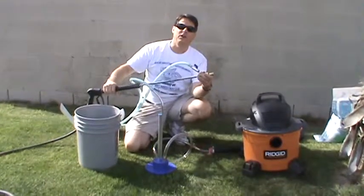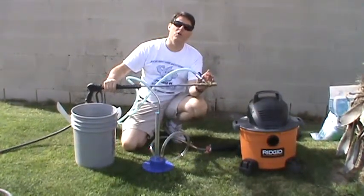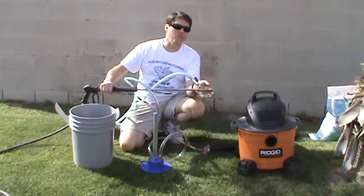What's also very important about the hopper systems, in addition to the media carburetor, is the blast head. The blast head is venturi driven, and it's controllable through our quarter turn valve here.